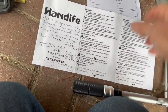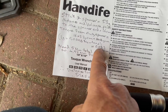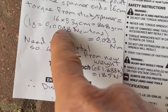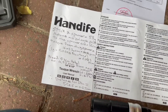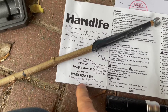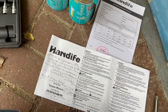I'm going to test the calibration at the stated 5 Newton meters — the certificate says about 5.1. So to apply 5 Newton meters, including the stick's contribution, I need 4.92 Newton meters from the weight. My weight is 1.88 kilograms, which equals 18.5 Newtons. The distance from the end of the stick where I need to place the weight is 5 Newton meters divided by 18.5 Newtons, which equals 27 centimeters. This point is marked with a pen at 27 centimeters from the end.